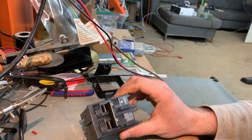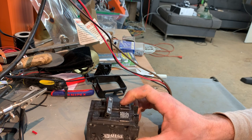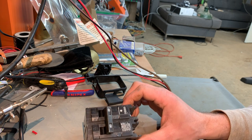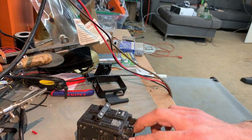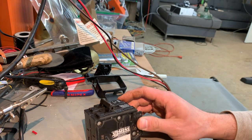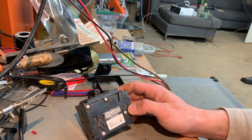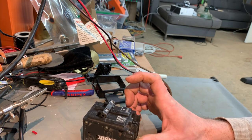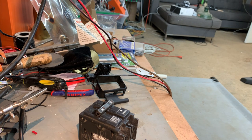I thought I'd try and check out this breaker — the one that was acting up, where one of the poles was putting out 120 volts but the other one was putting out more like 60 volts. I've never taken apart a breaker, and honestly I haven't really thought much about how they work. This is a 60 amp, 240 volt breaker. The two hots are here — it connects to the two bus bars in your breaker box. My assumption is there's like an electromagnet, a coil in here. The magnetic field of a coil is proportional to the current. When the current gets higher, that makes it a stronger pull and it will break the switch.